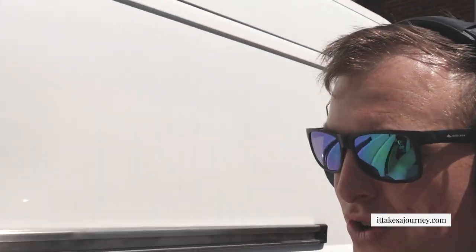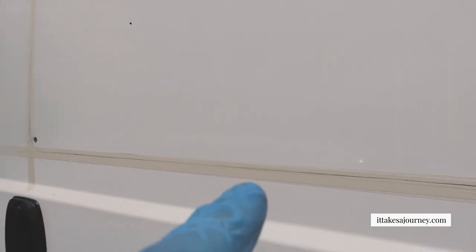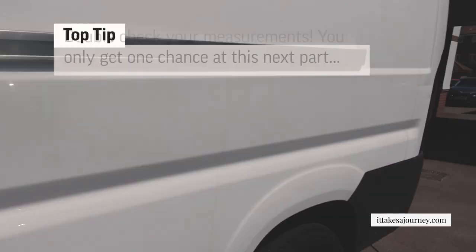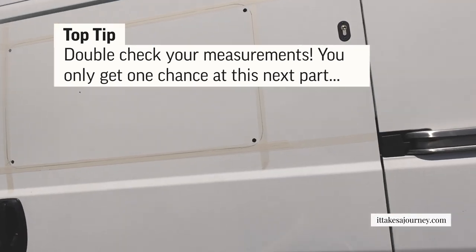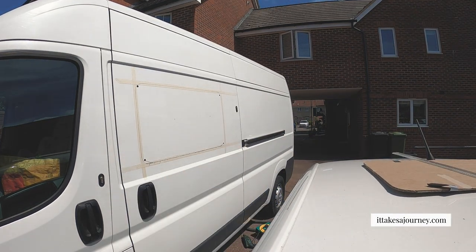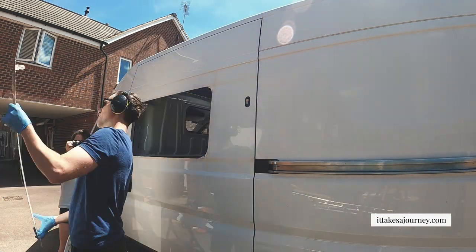Drilled four holes in the corners so I can get the blade in. My plan of attack is to do the bottom first, then one side, then another, and leave the top to last so it's hanging down. Double check the measurements off the bit of glass and off the edges, and double check from the inside at where all four holes are. We've fitted the jigsaw with a nice long new blade that worked really well on the roof — so we're ready to make the cut.